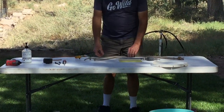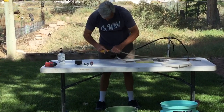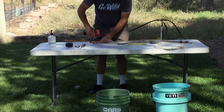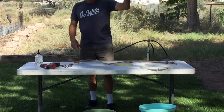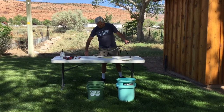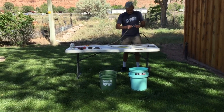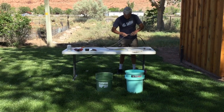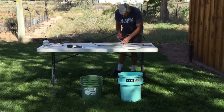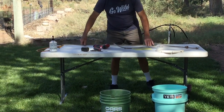We can assemble it fairly quickly. We'll put this five-sixteenths on top and move the clamp. This primer bulb has an arrow on it — make sure it goes toward where your copper tubing is so that you're pumping the water the right direction. The arrow goes towards the copper. Insert this on here, put the clamp on it, and tighten the clamp. It's important to get it tight, otherwise it'll bleed air and it won't pump.